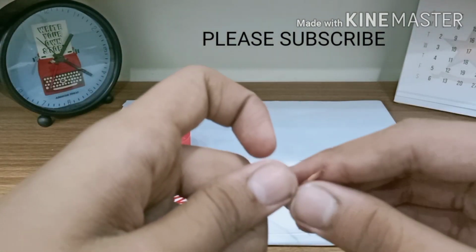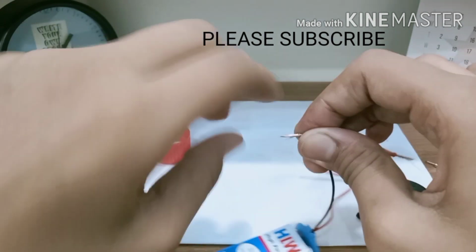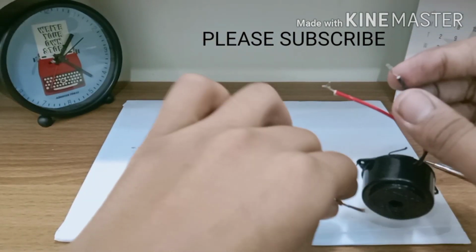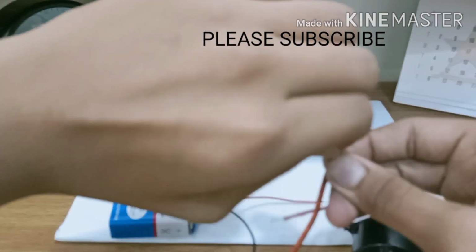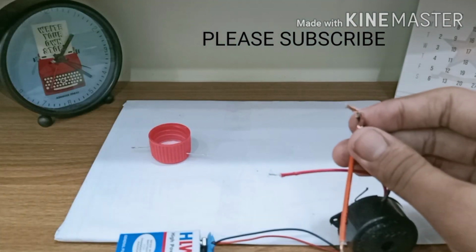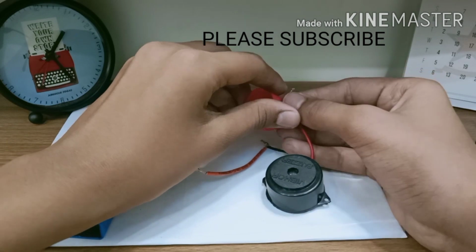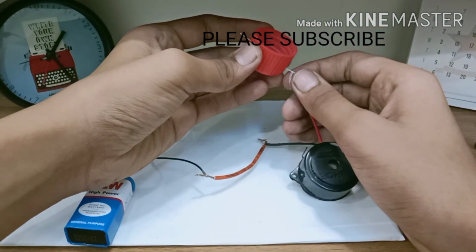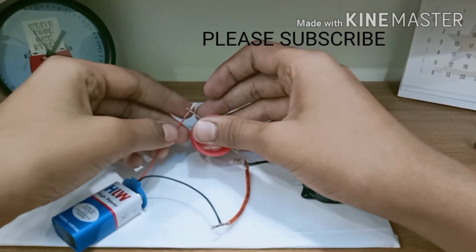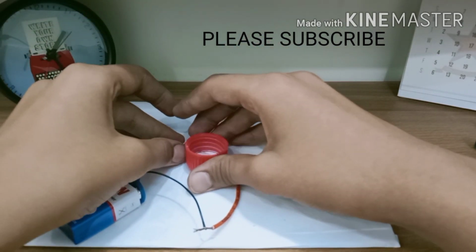Now you have to take your buzzer and battery and the piece of wire. Now connect the black wire of the battery to the black wire of the buzzer through the piece of wire you have taken. Now you have to connect the remaining wires to the ends of the needles respectively. One wire of the buzzer to one needle and one wire of the battery to the other needle. Now your circuit is ready.